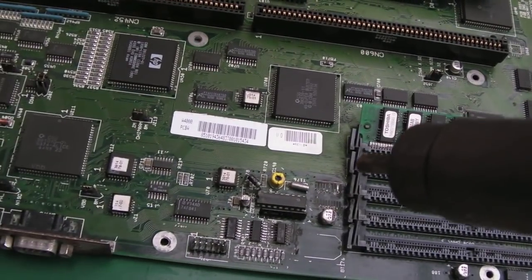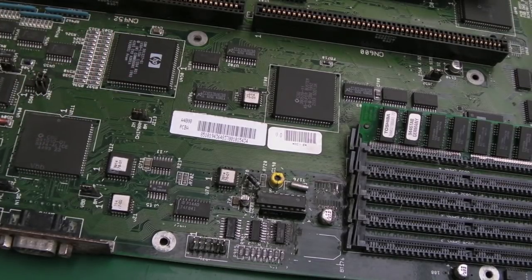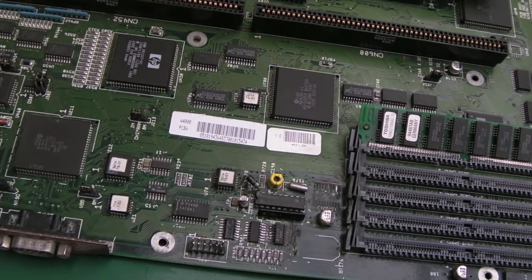But those 166s look flowed quite well, actually, and I've probed them with a logic probe and I see signals on all of them, so it's not like anything's high impedance around there. But I guess one of the outputs might not be getting to its destination via a via. It could be a problem with the CPU not booting, but I've tried both CPU cards, the slot's okay. So I've got the spare 166s.